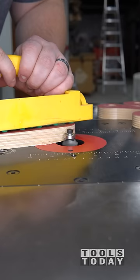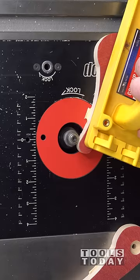We'll move over to the router table and get the tabs all flush-trimmed using the 49544 four-flute one-eighth-inch radius round-over bit, and also add a nice profile to the edge to make those nice to the touch.